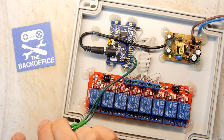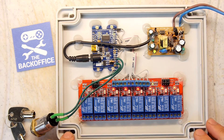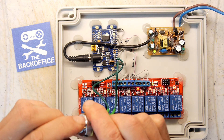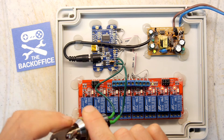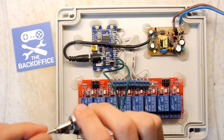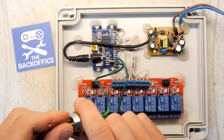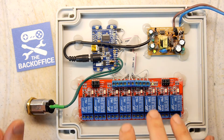When you operate the key again it will go through the off cycle, left to right in the same direction. You could change the firmware to do all sorts of things. It's designed so that even if the key is locked in an on position, it won't go into the off cycle until it's released. It's got a debounce routine on the key to prevent bounce, and also a kind of momentary latch — it's waiting for you to let go of the key before it will proceed to a turning-off cycle.